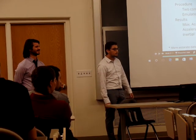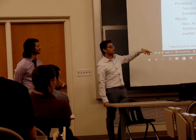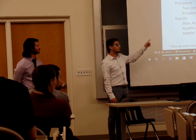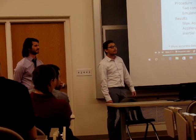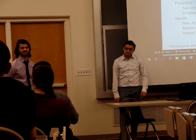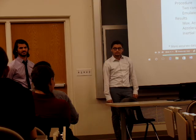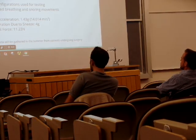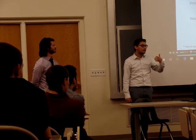The 11.2 Newtons corresponds to the inertial force - the weight of the robot is about 7.85 Newtons, and if you take that and multiply by the head acceleration, that gives you the inertial force we're working with. We multiplied the inertia times 1.4 times 4 to get the force value. We've used a spring scale and tested against that. More accurate data will be gathered over the summer with test subjects undergoing surgery, as this is going to be an ongoing project for the next couple of years.